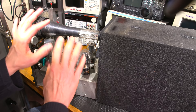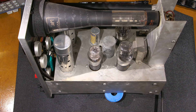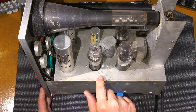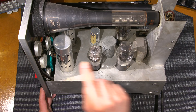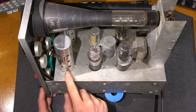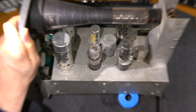I'll get the case out of the way — I may just desolder the cord and clip a new one on the bottom for testing. Then I'll take a closer look, analyze the chassis, and bring this thing up slowly on the isolation transformer and current-limited Variac supply to see if it comes to life. Here's a closer look at the top side of the chassis. Somebody has taken the time to write when they replaced components right on the chassis, which is kind of nice. It says 'new 885' — that's this tube right here, which creates the horizontal sweep. New 885, November 1961.